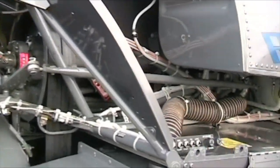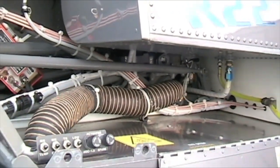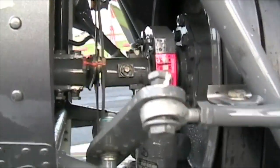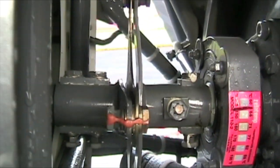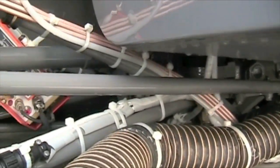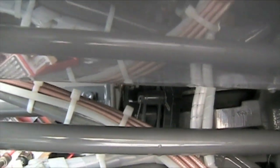We've basically checked everything in the main rotor gearbox compartment. I'm going to leave this open because I still want to be able to turn the driveshaft and check out the flex plate and yoke flange on either side. This is the middle flex plate and yoke flange, and the one up here that we checked — that is the front, the forward flex plate and yoke flange.